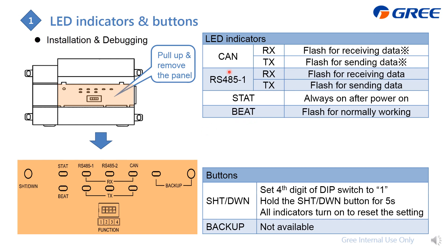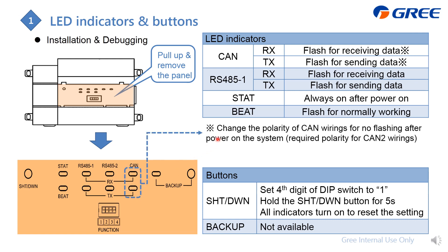Pay attention: for the GMV system's CAN connection, if you power on the GMV system and the CAN LED does not flash, that means communication is malfunctioning. To fix this, check the polarity — if the LED is not flashing, simply swap the CAN signal wires, meaning swap G1 and G2 in the wiring to the gateway.